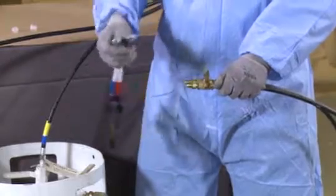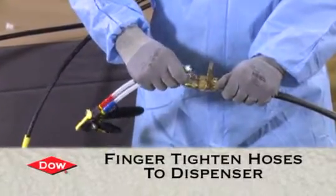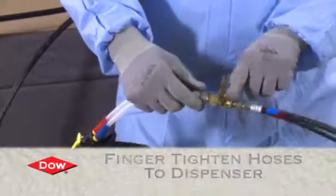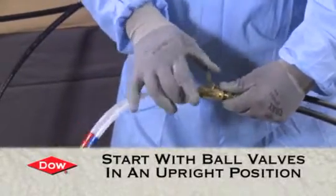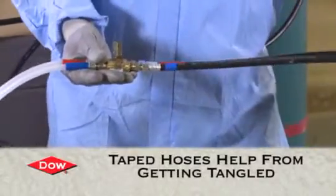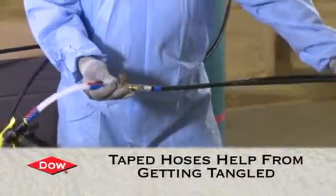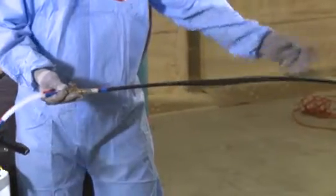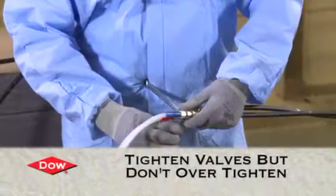We're going to attach the Instaflow gun to the chemical hoses, loosely at first so the hoses are nice and even — it'll be a lot easier for the operator while spraying. I also like the ball valves in an upward position so when he wants to start, all he's got to do is push them down — they'll lay nice and flat and don't get hung up on anything. A helper is taping the hoses together every 18 inches or so to keep them even, which makes it a lot easier in the shop. Then we'll come back with crescent wrenches and tighten everything up.